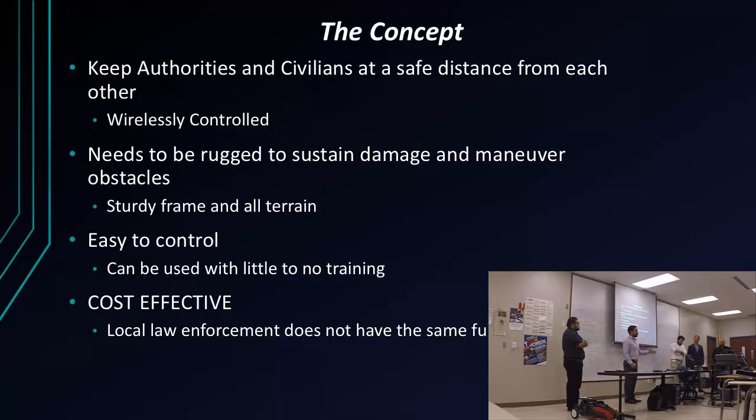So what we were trying to do different this time was to build an actual robot where we could have the precision, and we could limit the time that it would take to aim at a target, and have our video feed on a tablet or mobile device, so that wherever you put your finger on the screen, the gun would automatically lock on to that target. Wherever you click is where you shoot. Obviously we don't have the resources to attach a laser rangefinder to give us a distance, which would let us fix the elevation. So we were going to simulate inputting distances, and that would fix our elevation. And then we would just control the X and Y direction with our fingertips touching the screen.